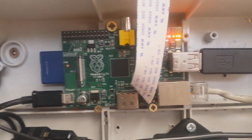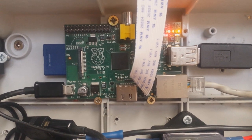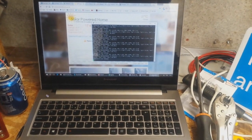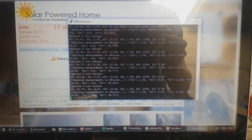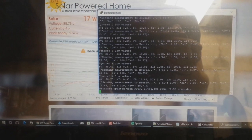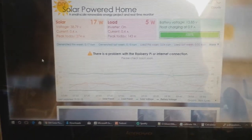It uses a protocol called Modbus, and all you need is a USB to RS485 adapter and the necessary Modbus library installed on the Raspberry Pi. If you don't know much about the Raspberry Pi I suggest you go and find out about it — they're very useful micro computers with really endless capabilities. My Raspberry Pi is running Raspbian, a specific distribution of Linux designed for the Raspberry Pi itself. I wrote a small Python program which reads the data stored in the charge controller every few seconds and submits it to my website. There's quite a lot involved in this side of things, so do check out the website if you want to know more.